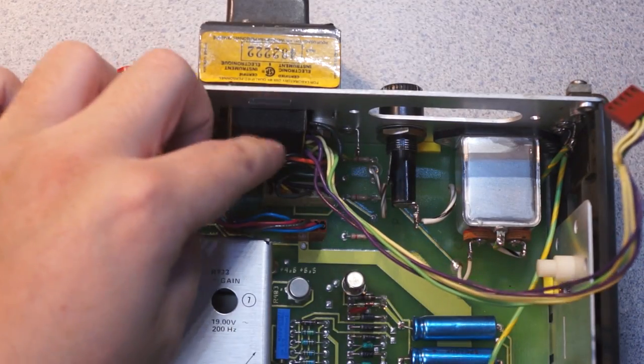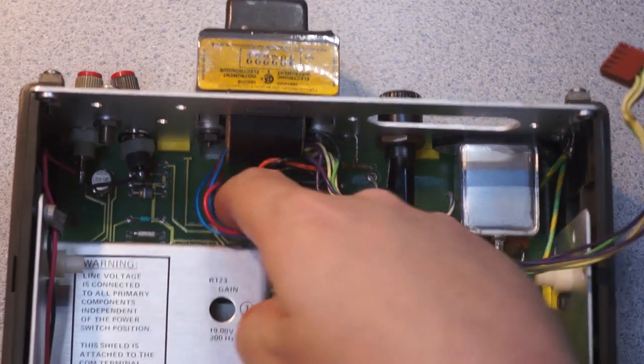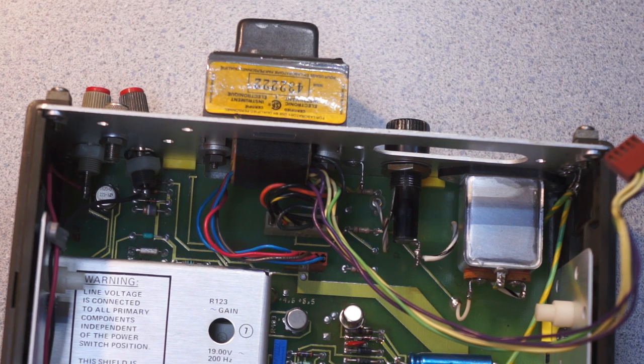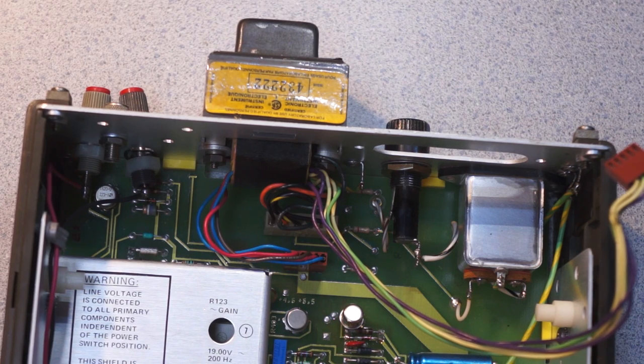You can also see that they've got just a whole bundle of windings on the transformer. They've got separate windings for the HPIB interface. So presumably, I'm not sure if they only used one transformer and then this was just not connected sometimes or what. But that's kind of interesting. So here's the input and you can see we've got nice bonding to the chassis ground.